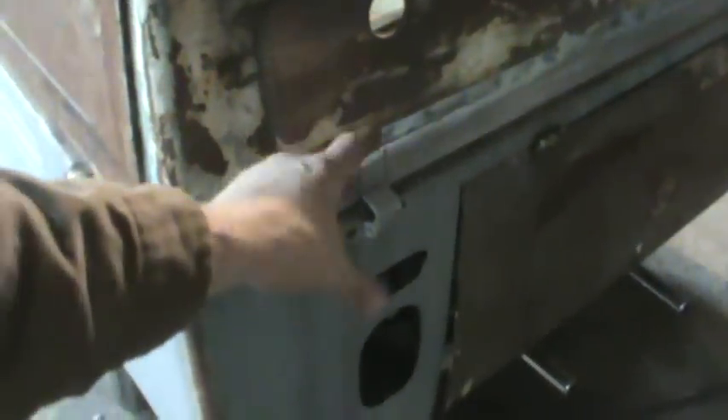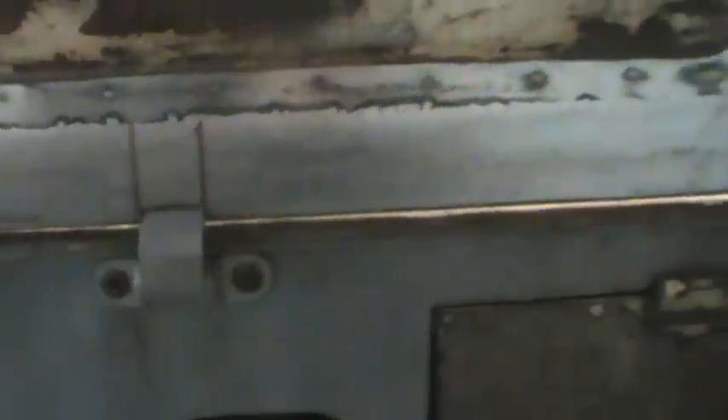The old one had a bunch more sheet metal in there — I thought it once again went against the back wall, but it doesn't. To fix that, I'm going to just buzz right across the top here, and on the other side the net will allow me to take it back apart again and catch that one from the bottom. I might be able to build up from the inside. As long as they catch the face and the bottom of it, it should be pretty strong. This is 11 gauge, and what it was originally attached to was 20 gauge, but spread out further. So I'm much more stout than before, especially after I weld all the way around. I'm going to get on that and see how we make out.